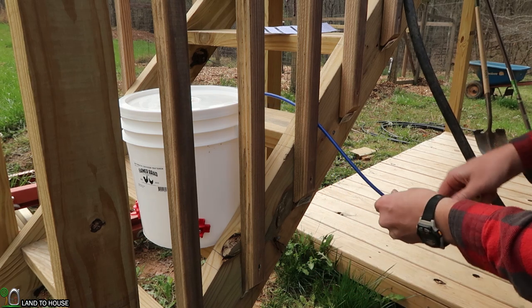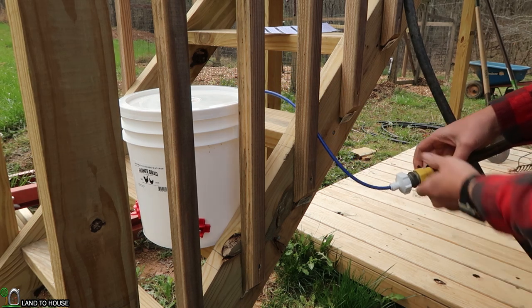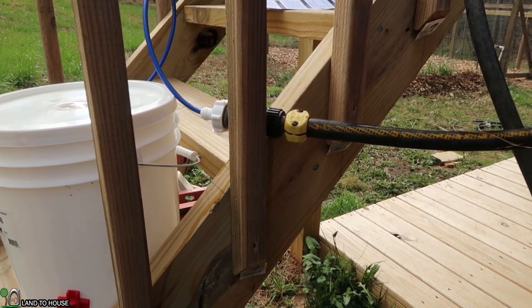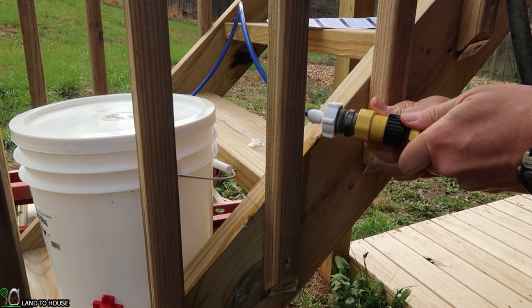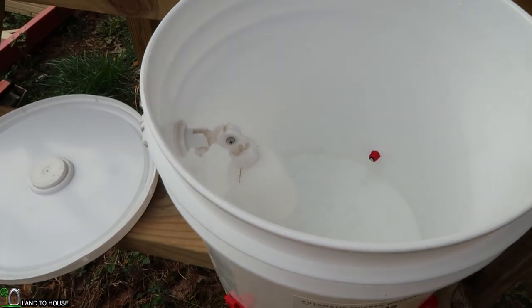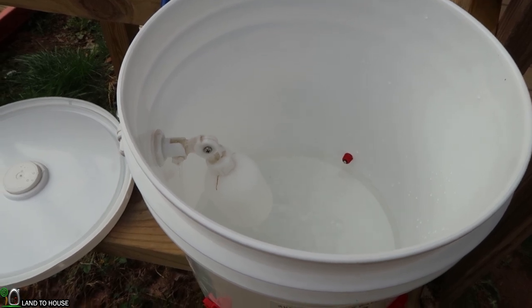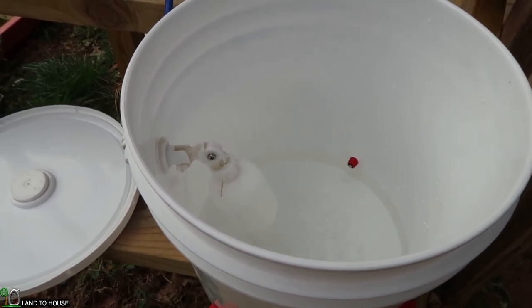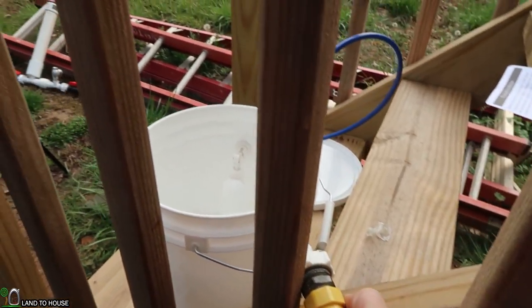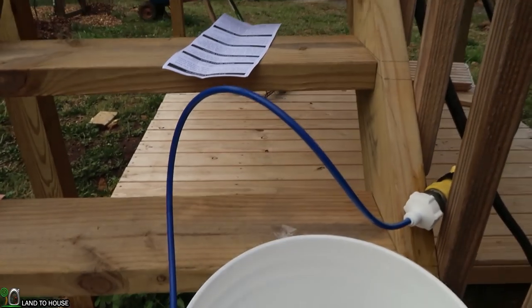I have the bucket here and this little tiny hose. I'm going to hook this up to the ram pump directly. Let's put that up there. Now let's go ahead and open this up and we will watch it start to fill the bucket. I'm just going to flip this switch a little. Okay, it's filling into a little hole right up under the float valve, and it's going really slow — which I like, because with all the pressure behind the ram pump, if it were to open too quick we may have issues with back pressure loss. So far this is working out really well. Let's see what happens if we open this all the way — no real change. I think it has reached its maximum fill rate with that hose size going in there.